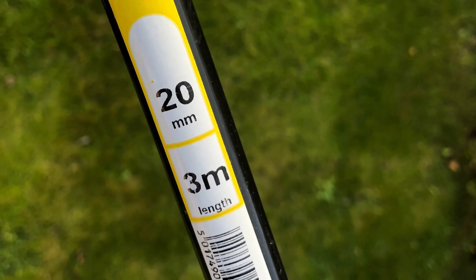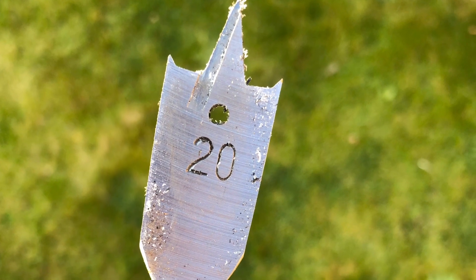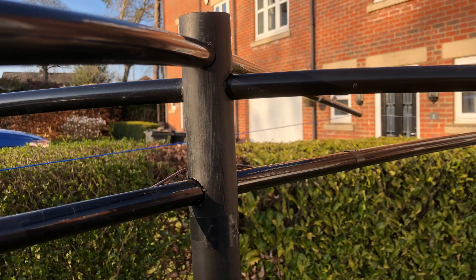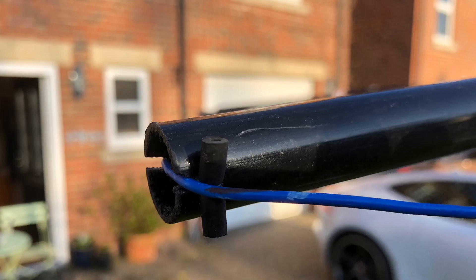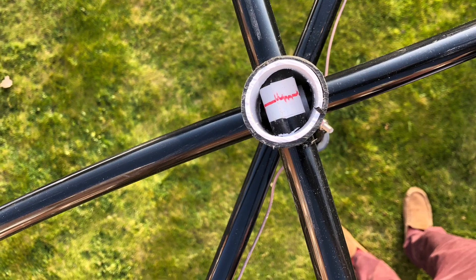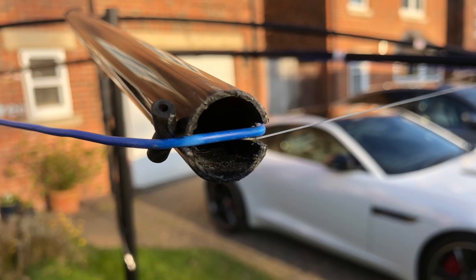For the arms there's this 20mm flexible conduit - you can get it in white as well, I just went for black. Something really handy is a 20mm drill bit to cut the holes for the spiders. The first cut is to ignore the bottom one - the top two spider arms are just 90 degrees opposite. I've cut grooves in the end of the four spiders to accept the wire and the tension line. I've also marked the center of the pole so you know when to stop when inserting them in the stub mast. To tension up the ends I've used some fishing line - 30 pound I think - with some rubber connectors just to hold it at the end of the grooved arms.